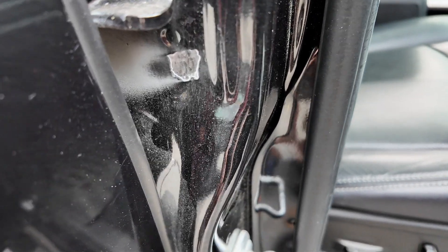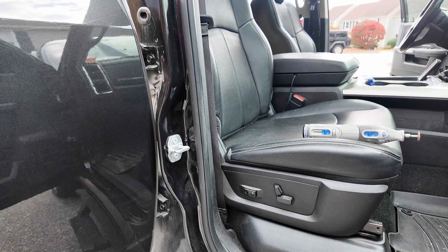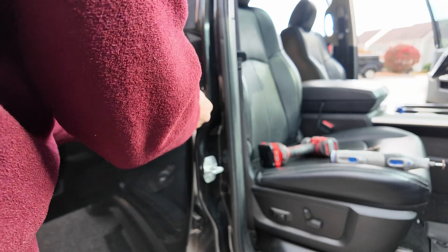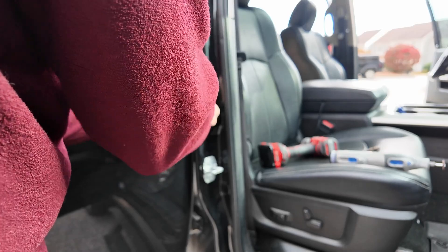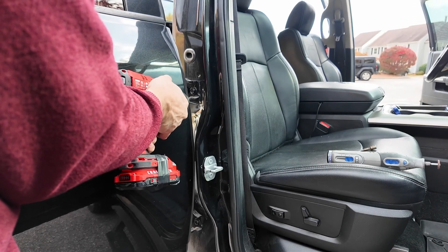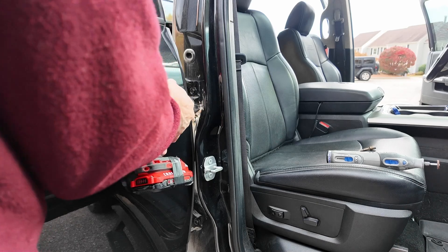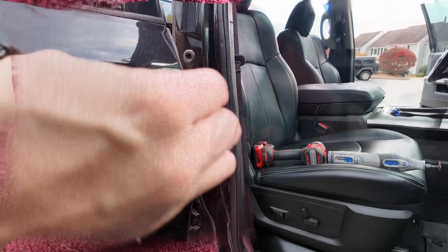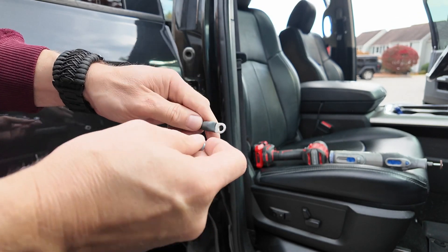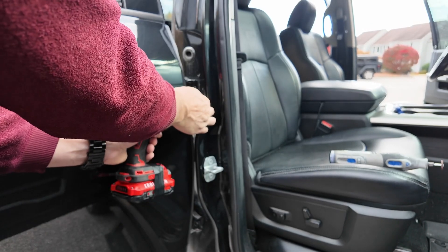There you can see I got down to the metal. At this point I'm just going to tap a small hole to start, and then from there I'm going to put the screw in and attach the grounding. I've got a washer with the strap and I need to pay close attention to the fact that the flat side of the strap is going the right direction so when I actually screw this in everything goes in the way it should. We're just going to tighten this down now.